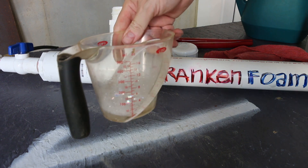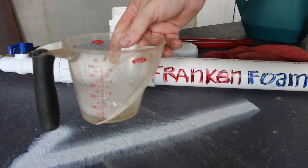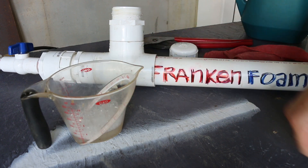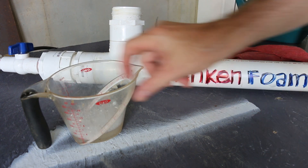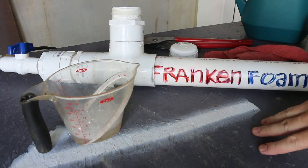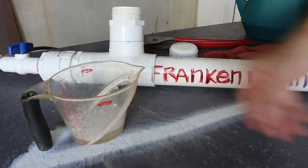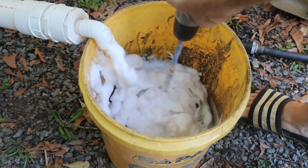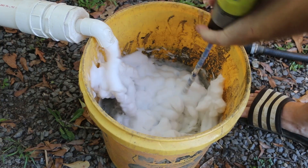It looks like I only had a couple ounces of solution left. Interpolating those results — the seven and a half gallons of foam — I'm guessing those two ounces would produce maybe another half gallon or a gallon. So eight to eight and a half gallons of foam for two cups of solution. That plastic covering may have slowed the foam degradation a little bit, but not much. It's still best to mix your foam into your concrete slurry immediately.